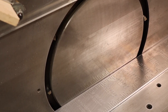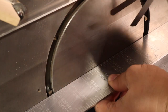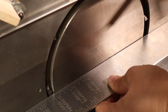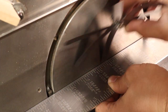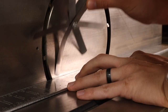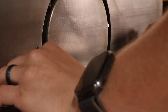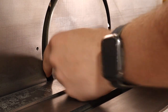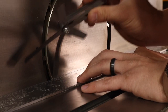There is one extra step when working with a Uniplane: getting the center fence depth set correctly. You're going to set the infeed fence to zero and then make sure you have about two to five thousandths of an inch on the center fence, which gives you the third cutting pass — the finishing pass. This was a little bit tricky because it wanted to reset itself once I tightened everything down. I found that if I set it to about ten thousandths while things were loose and then gently tightened everything, I was able to get it within that two to five thousandths mark.